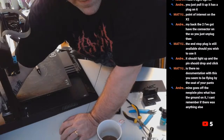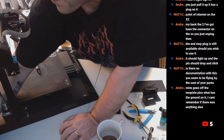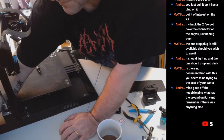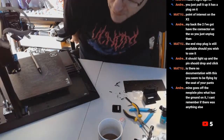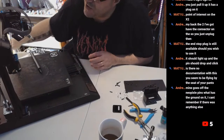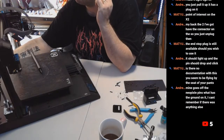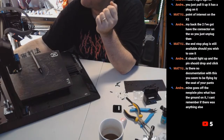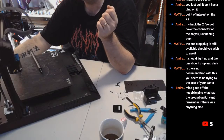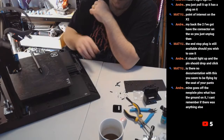Let's have another look at these. It doesn't even say whereabouts they are on the board. Let me just try and turn this on now. See if we get any power to the BL Touch. Nope. Everything else is registering. I really do not know how that BL Touch is getting any sort of information to it.